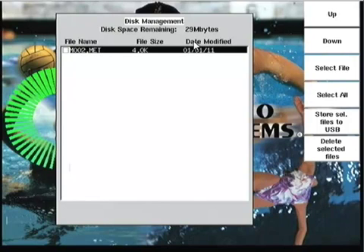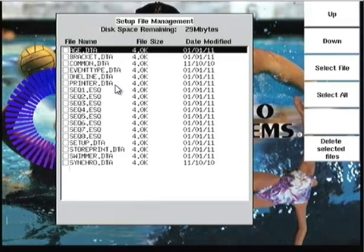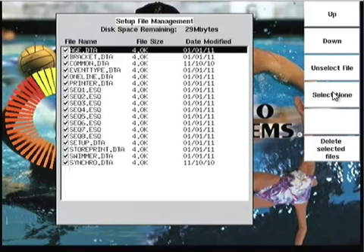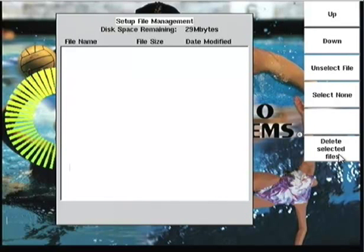Now I'm going to go into Setup Files. Setup files are basically the instructions for the timer each time it starts into the various sports — swimming, diving, and so on. Think of it as your configuration settings for those sports, such as what your pool looks like. If you go to load swimming, diving, or water polo and it tries to go into the sport but then comes back out to the Sport Loader screen, something has gone wrong — someone has not shut down the timer correctly and has created a corrupt setup file. You can go in, select all of the files, and delete them. All the potentially corrupted configurations are gone; don't worry, those files get recreated every time you start up the sport.